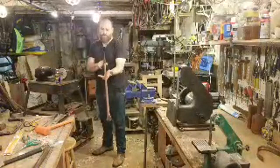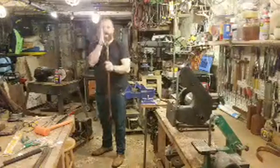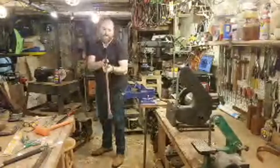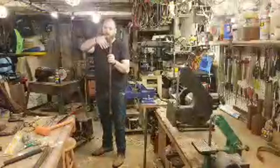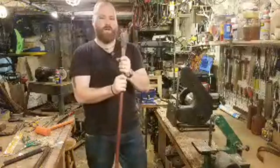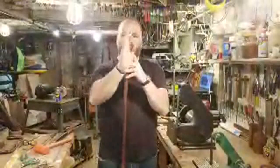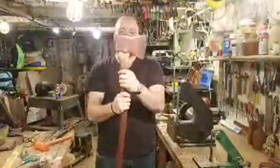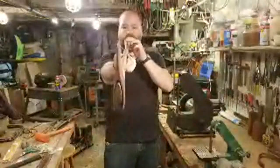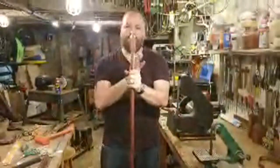The blade is still straight down the handle, which is great. That means I'm not taking too much off of one side or the other. So as it's going down, it's staying straight up and down. If I take too much off of one side, you'll start to get some twist. The way you can remove twist from the head is, if it's twisting one way, you take a little bit more material off the other side. So if it were tipping to my left, your guys' right, that means there's too much material removed from that side, so you can take some off the other side and it'll bring it back. It'll let that cheek sit down more on that side. If you get to the point where your handles or your axe heads are not running straight down your handle, then it's because you're taking too much material off of one side or the other.